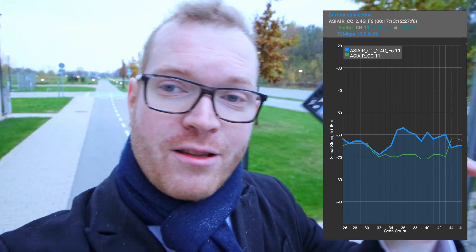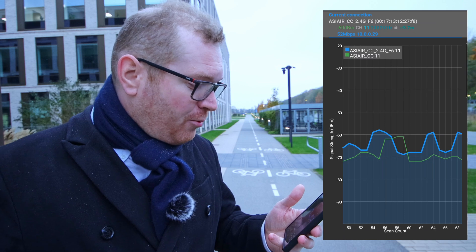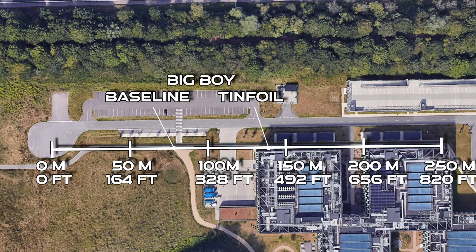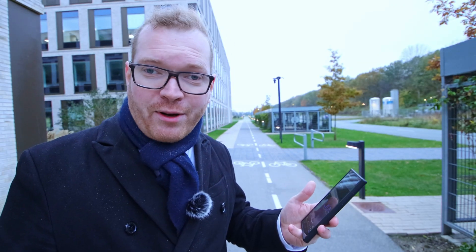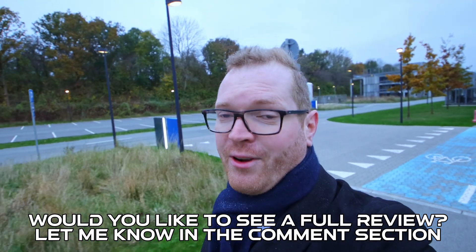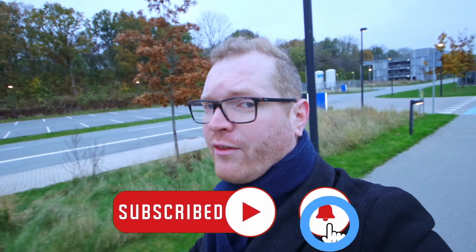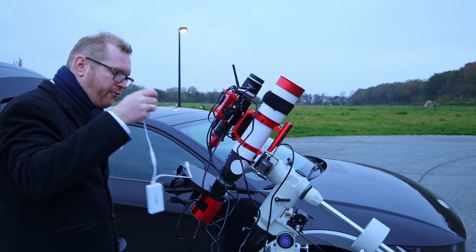So we're going to walk further and see how far we can get before this thing drops out. We're back into the same behavior as before — a bit unstable, kind of bouncing all over the place. Sometimes we get up to minus 60, sometimes we drop down to minus 70. But before we were at the end of that building over there with the normal Wi-Fi, but with this we actually managed to get quite a bit further than that. I'm actually kind of surprised because I thought with no external antenna, surely we won't be able to reach as far, but clearly good hardware also means good range. I do have a link for it in the description — I'm not sponsored or anything, by the way. I bought all the items you see in this video myself.